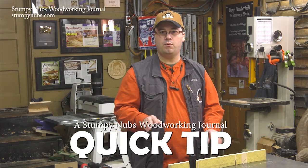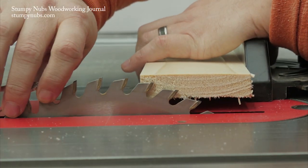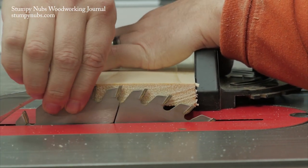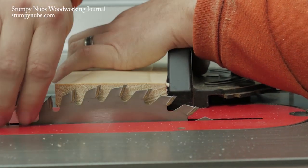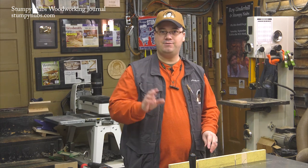The biggest thing you have to watch out for when making a crosscut with a table saw is tear-out, which occurs where the teeth exits the cut on the bottom and back edge of the workpiece. This is the biggest cause of poor crosscuts, and learning how to avoid it will make your projects look a lot better. So here are five solutions.